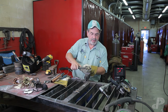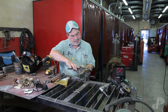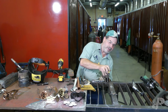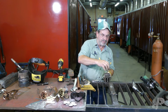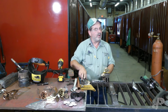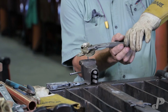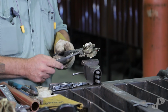And I've talked with the students, I have my own standards as far as welding goes. I chip every weld. If I'm stick welding, I wire brush every weld. If I'm TIG welding or stick welding, that's part of it, and I don't care what a supervisor tells me to do. Those are my standards, and it's going to get done. If I'm not the right guy, if you want to push it through or whatever, you need to find somebody else. Okay, so that's something that the students can look forward to, kind of that experience, that fine detail, you incorporate that into your instruction.